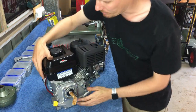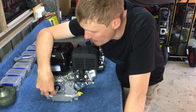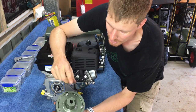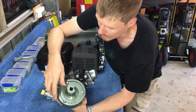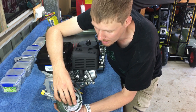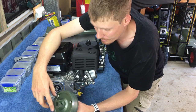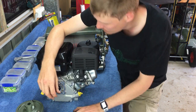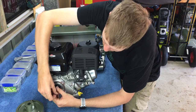This is a 5/8 shaft - you can see the shaft is 5/8. You can also get it in a 3/4 shaft, so if you are ordering an engine, just be careful of the shaft size you're purchasing. That's all determined by your clutch half - my clutch half has a 5/8 hole. If I had a 3/4 shaft, it simply would not push onto the shaft - you'd have to change either your clutch half or your motor. We do need a cotter pin for this clutch, and an engine key that will slot into the keyway underneath here.